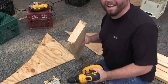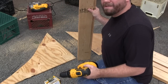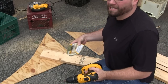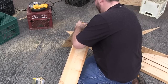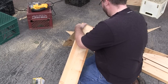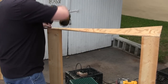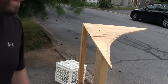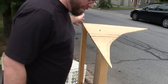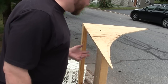You don't have to use 2x6s or 2x4s — this is just stuff I had left over from another construction project. You can use 1x4s or whatever. Since this is going to be an outdoor project I'm going to use deck screws to finish it off and I'm going to paint it when it's done. To keep everything square and parallel I measured from the front of the jump to where each cross piece went, so all the cross pieces are exactly parallel and the whole jump stays square.